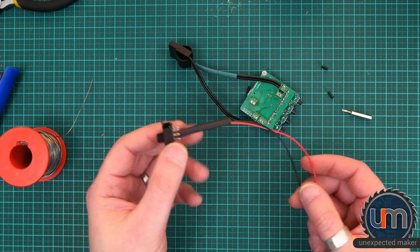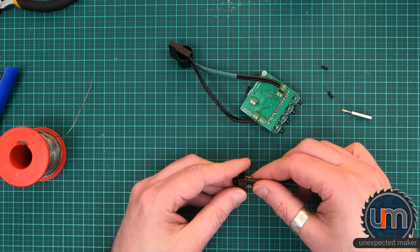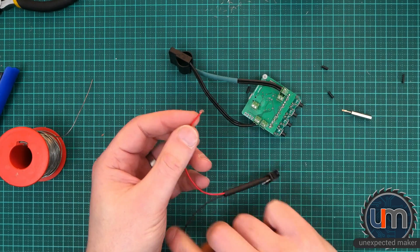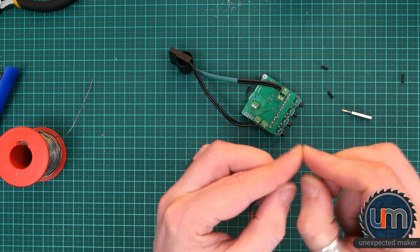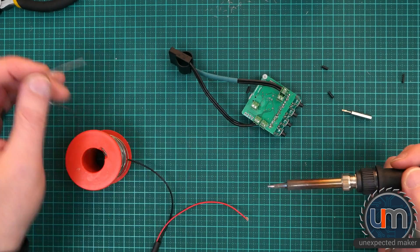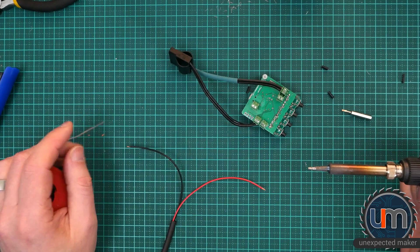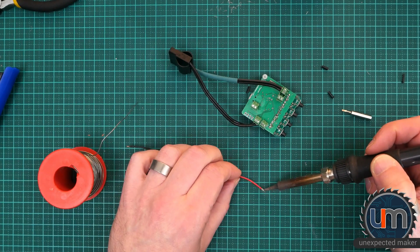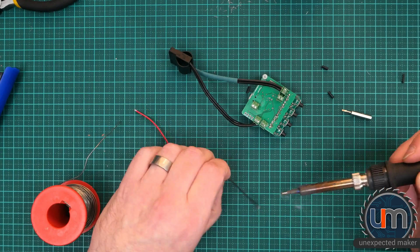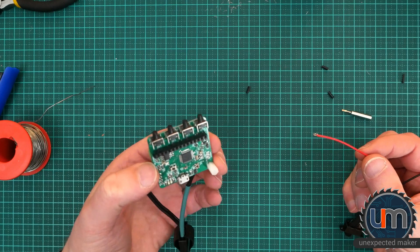The switch — I'm not overly happy with using the gauge of this wire on this switch, but for the moment it doesn't really matter. I'm going to screw it in. I might have to solder the end of this to give it some thickness and something to grip onto. I'm doing a triple bend at the moment. I'll add some solder on these — I want them to be chunky — but small enough to actually fit. Just enough to hold it together.